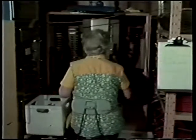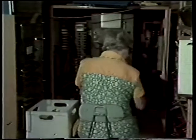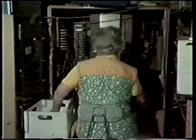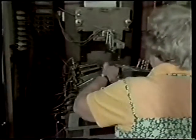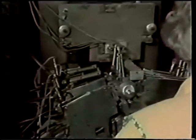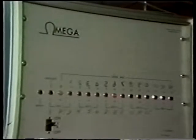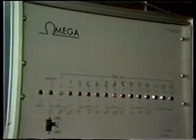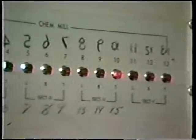Airfoil sections of blades are usually up to ten thousandths oversize. A method of measuring airfoil sections has been developed to accurately determine how much material must be removed to meet finished drawing requirements. Each blade is measured at a minimum of three sections simultaneously using electronic probes. Immediately, the display panel indicates if the blade is okay, oversized, or undersized. Oversized blades are identified by the amount of stock needed to be removed as indicated on the panel.